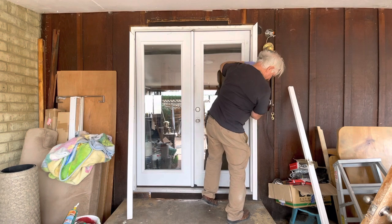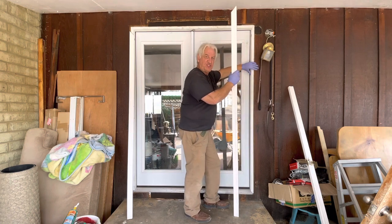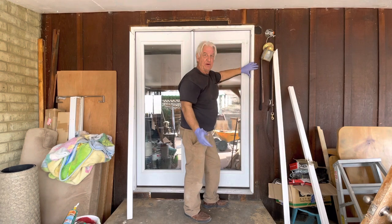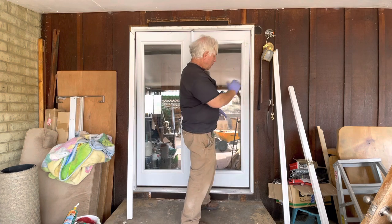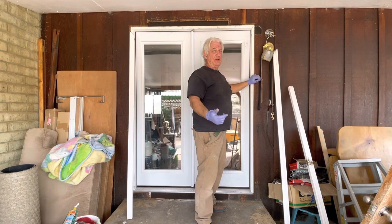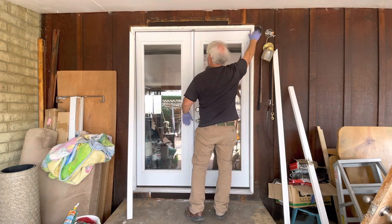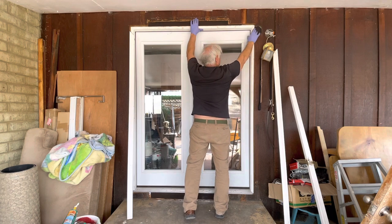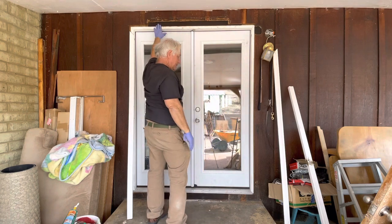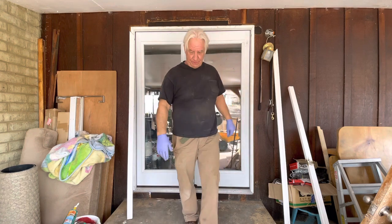Ultimately what you're trying to do is overhang this onto your surface, whether it be stucco, wood siding, hardy siding, metal, it doesn't really matter. You really want it to overlap, because that gives you a super clean joint and a better weatherproofing joint. I put back the siding, or this insulation board underneath the siding. I'm going to close this up, I will show you that, and then I will show you how to rabbet cut these and install them.